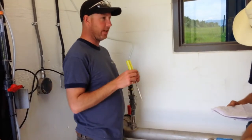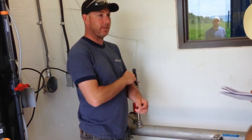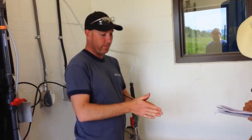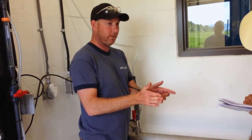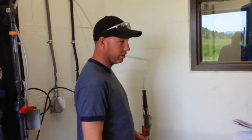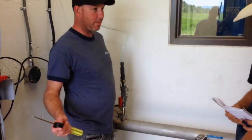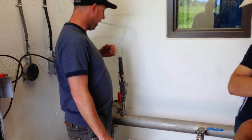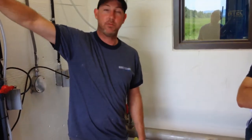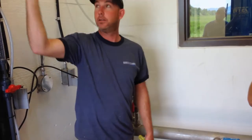And there's a little rubber tip, a so-called duckbill check. Have you seen a duckbill check? It's basically like a piece of tube that just holds flat. When you put pressure on this side of it, it'll open. When you put pressure on this side of it, it'll close. So you're just looking at that tip and just making sure. I mean, what I would like to do is stop my pumps. Probably depressurize the system right here, because that's going to depressurize from here all the way back and out into here.